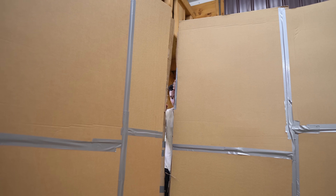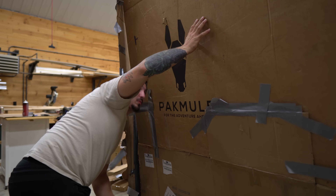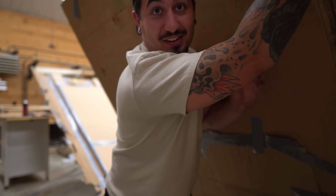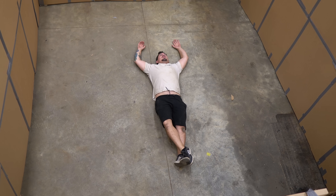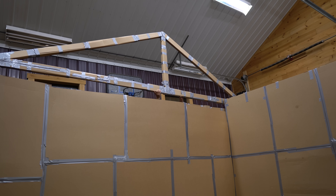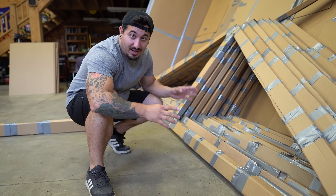I did my best to put the walls together just to see if this was structurally sound — and I almost broke my camera in the process. I've got my front door, back wall, and the other big wall. These ceilings are mega high — seven feet tall. Which raised the question: how was I, a 5'7 real-life Mario, going to set these trusses on top of the walls? I wasn't having any luck. There's no way to set these trusses one by one on top of the wall, so I'm going to build the roof on the floor, connecting the trusses to the beams one every 18 inches.